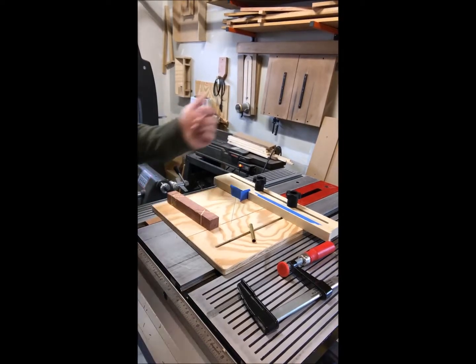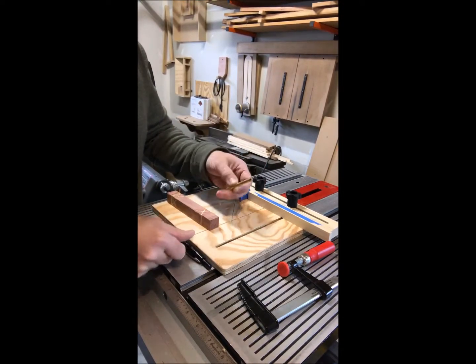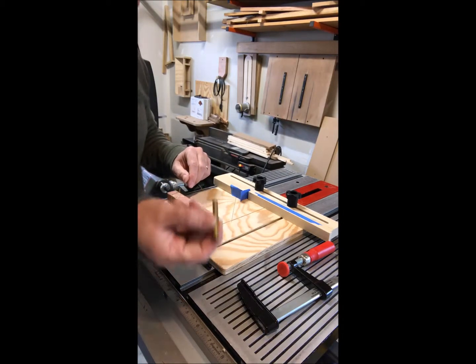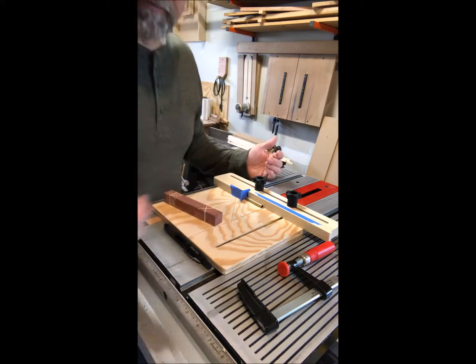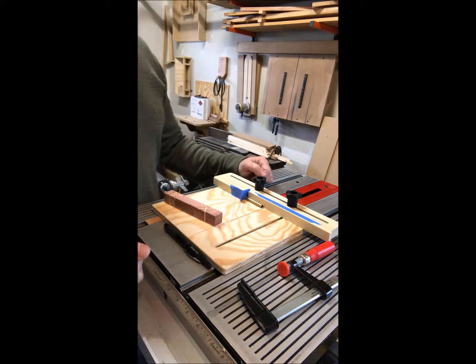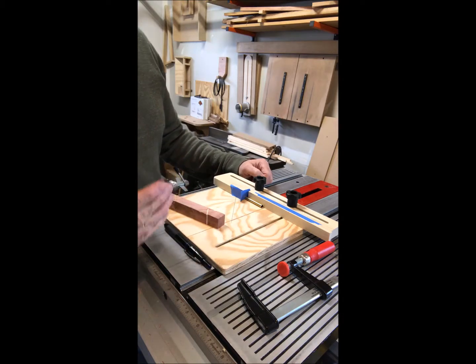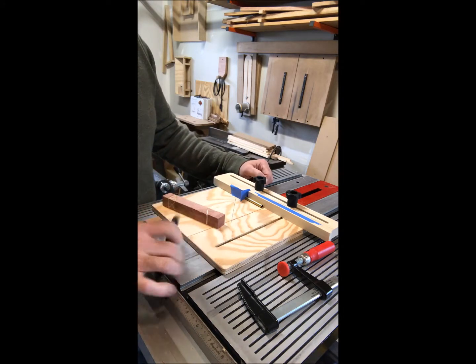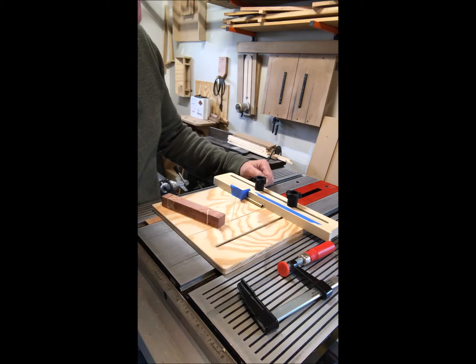All right, so ready to get everything set up for the segment cutting now. Again, it's a trim line pen. This is the tube for the trim line. Easiest way to set this up, generally I want about a 1/16 of an inch at each end of the tube once it's inserted into the blank for squaring. So what I want is about an 1/8 of an inch at the end of the pen, between the end of the tube and the bandsaw blade.